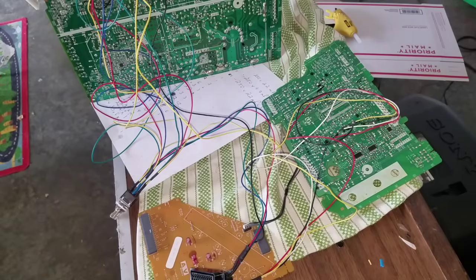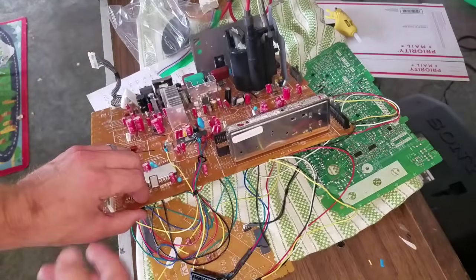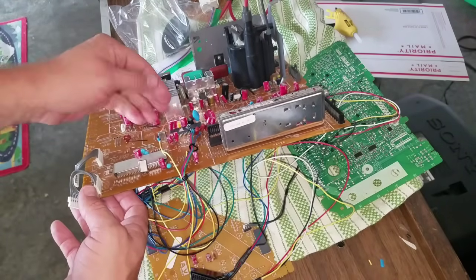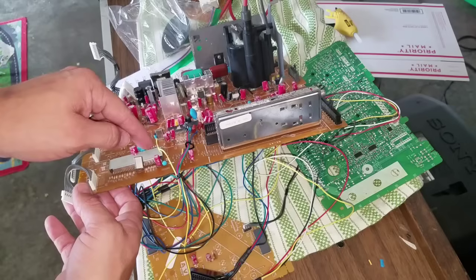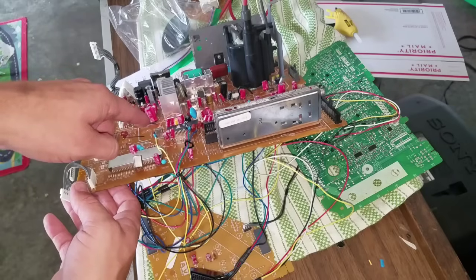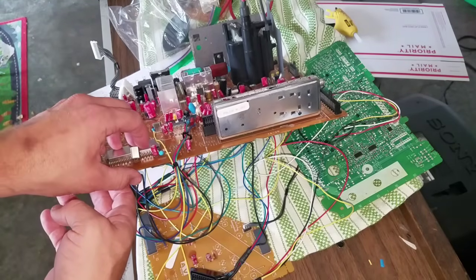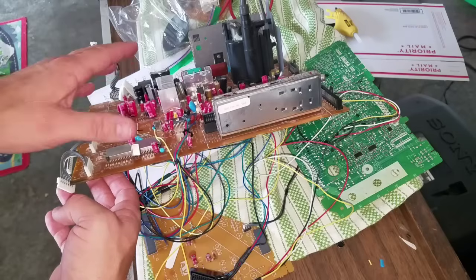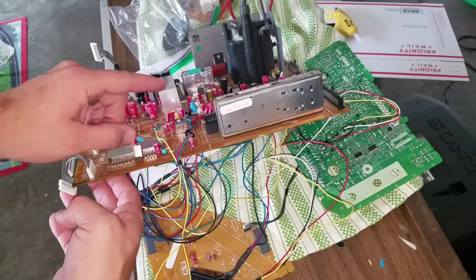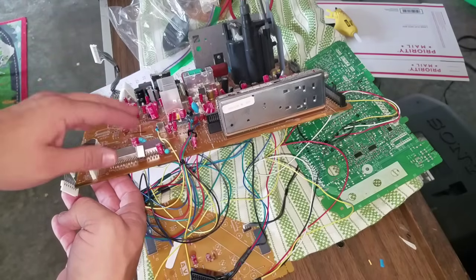Welcome to the overhead view of the board. The way this modification works is you're going to tap into this jungle chip here, removing the pins that allow you to go in with RGB — red, green, blue — and then there's a blanking input for the OSD. You're tapping into those lines, removing the old signal, and putting a switch in that goes into the chip. Then we'll have a selection where we can have either the original operating system or our RGB signal along with a power supply into the chip to activate it.